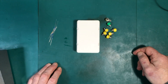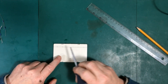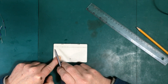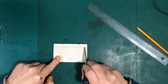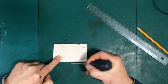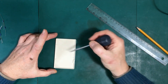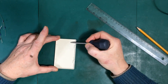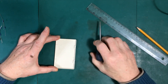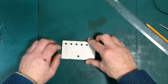We've done the basic layout. This is exactly 102 millimeters long. Starting at 11 millimeters and going up to 91 millimeters, I put in a tick every 16 millimeters along a line that is 11 millimeters from the edge of the board, and also one here in the center, also 11 millimeters from the edge. This will be the common, and these will be each of the resistors. We'll have a copper rail going down here connected to the common, then resistors from each socket over to the common rail. Now we just have to drill the holes — and all the holes are drilled.